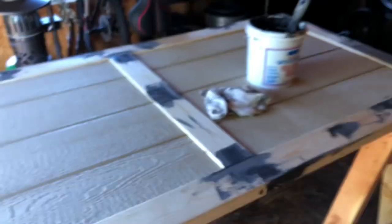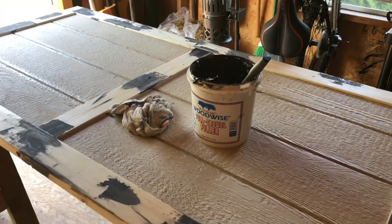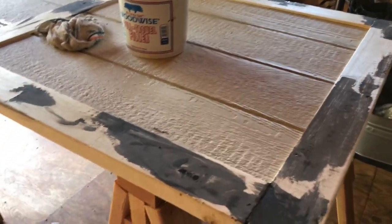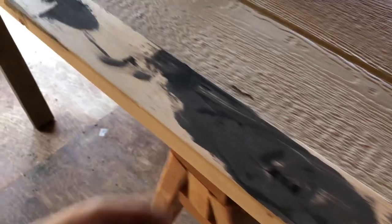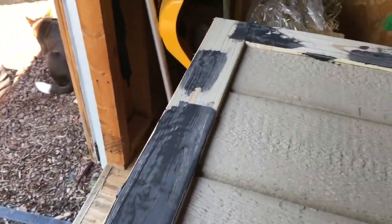So it's been about a week since I recorded anything on this door build. We had some family come in town, which put a stop on the project for a little bit. But yeah, we're to the point now — it's at Mom and Dad's house, at their shed where the doors are going to be hung. We're doing some filler. I had to trim the doors just a hair to make them fit, so we ran them through the table saw to take about an eighth inch of width out of each door. And now I'm going through with caulk and this Wood Wise full trowel filler — primarily used for hardwood floors but I use it on a lot of different projects. I've never used it exterior, so we'll see how it lasts. I feel like it's going to be fine since it's going to be painted with an exterior grade paint, so it should protect it. I'm using this to fill in the little imperfections, anywhere there's a knot or pores.